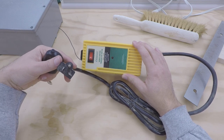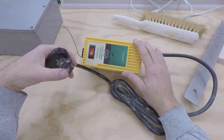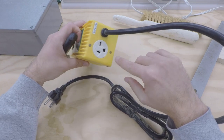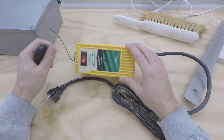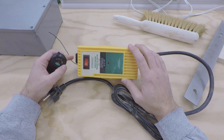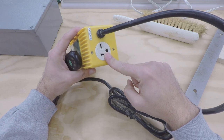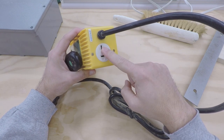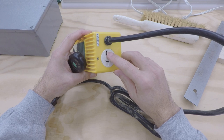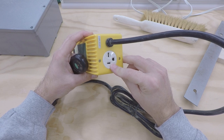It's got a 20 amp 220 plug — the 20 amp has one prong sideways and one vertical, while 15 amp has both sideways on the plug and receptacle side. I took it down, plugged it into where my table saw plugs in since I have 220 right there, and put a meter on it. When I pressed the button and heard the relay click, one side would stay on and one side would stay off — so obviously something in the relay got burned up.